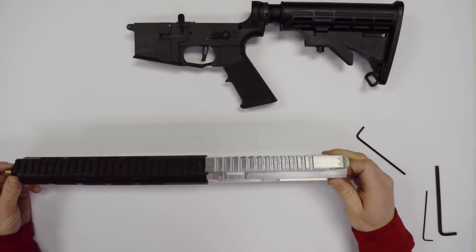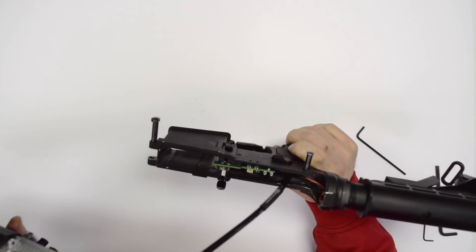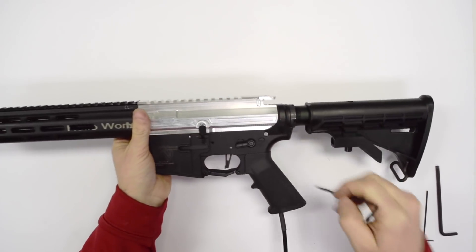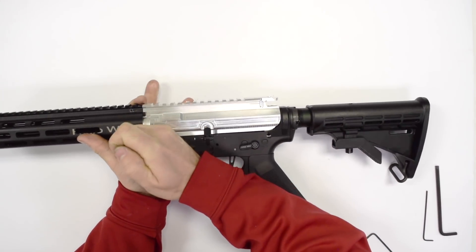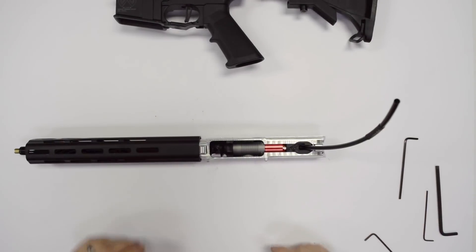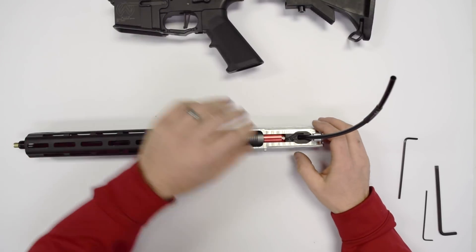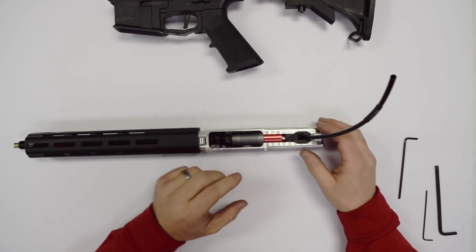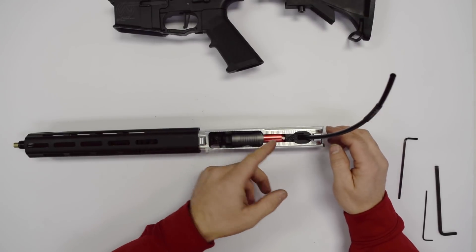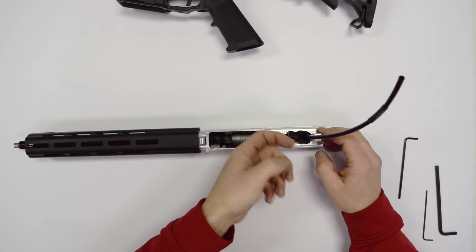We've swapped over to our fresh, uncrushed receiver. To get to this point, all you've done is pop out the two body pins — no tools needed. Now let's disassemble the upper receiver. One of the most important design features was the wireless connection between upper and lower receiver. We wanted something robust — we didn't want to use a standard pin design because pins bend, and the copper or brass tabs they use have a tendency to bend and break. So we designed this in-house using spring contacts, which are very robust, with simple screws on the far side. To disassemble, just pop it out, then unplug it from the back of the solenoid and run your wires back through.